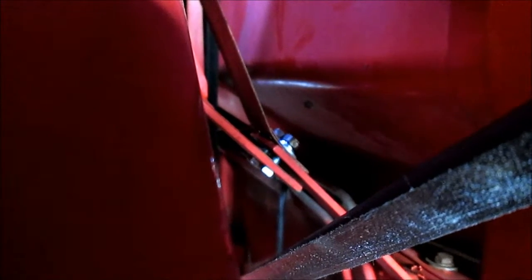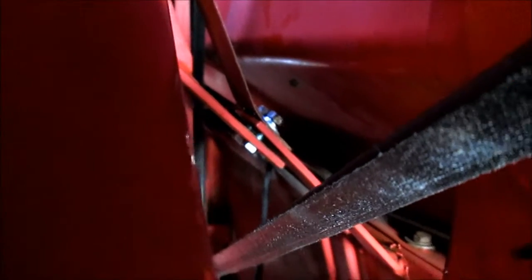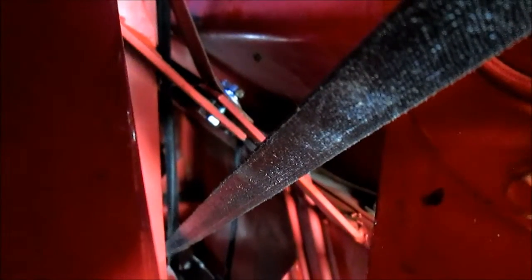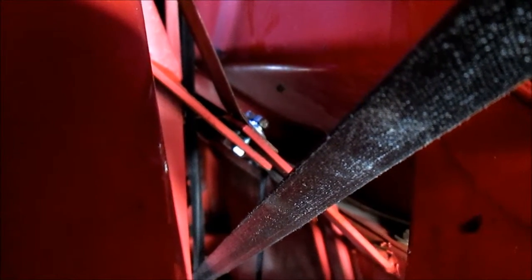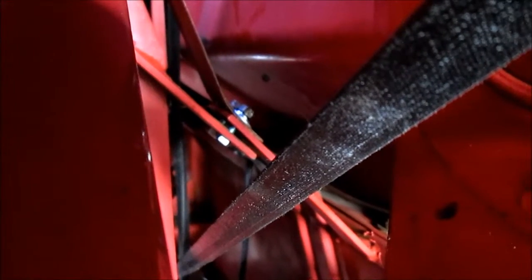Something simple I like to do in the way of cheap maintenance on a repair like this that is in a tight confined space is change my bolts out. Factory originally, these came with a flat-headed pan head 1/4 inch bolt, and you have to remove this tank band to change the straw walker belt right here. And they had that in a confined space. A small flat-headed screwdriver wouldn't even fit in there. I had to use a bit on a needle nose vice grip to hold the back side and then turn it off with a 7/16 ratcheting wrench. And that's just a pain in the neck all the time.